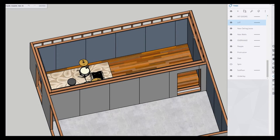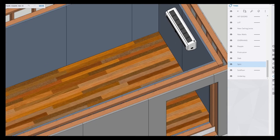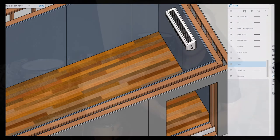One of the things right now, I have a window, we call it a PTAC, but basically it's a window air conditioner here for the space. Obviously for this project, that's not desired. That's essentially a hole through the wall. So that gets demolished. We have our new wall, and we're going to put in what we call a split type air-cooled heat pump. And everyone's seen these things, right? So all this does is provide you conditioning in terms of heating or cooling.